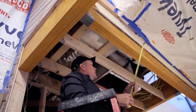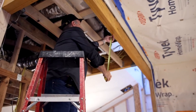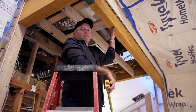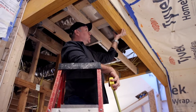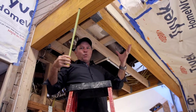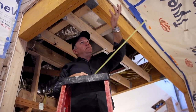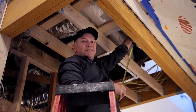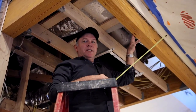Here we opened up multiple places — three layers wide, 14 inches tall. And then we've got this one, which is much bigger: it is actually 18 inches tall and two layers wide. Depending on what type of room you have for height and what you want to show, how you finish out a beam like this — whether you go with sheetrock or wood trim around it — can determine whether you want to go wider or taller. This one's 18 inches versus 14, and they're going to carry about the same amount of load.